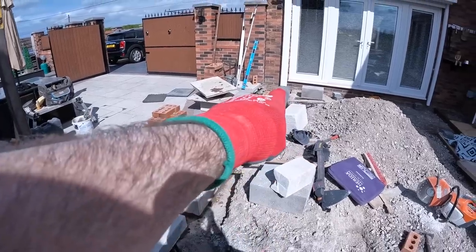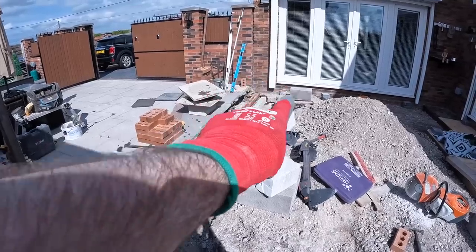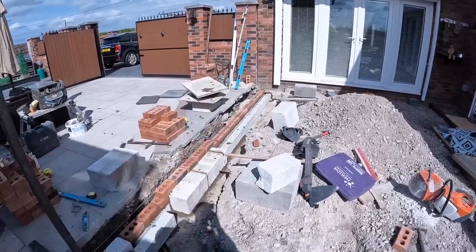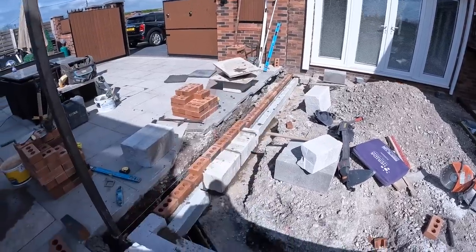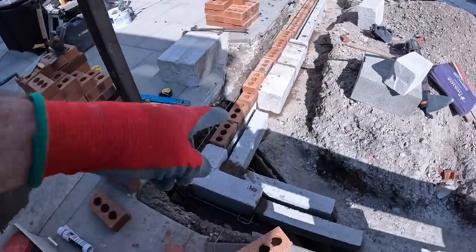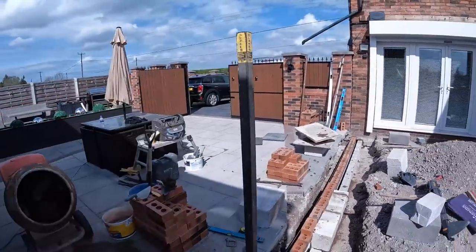So the bedding is the wall, you just see a bit of block work underneath there. They're bedded in tight, then they span across the crap. Even though it's reinforced and plugged into the wall, we're still playing it safe and putting the lintels in. A couple of trench block, all lintels over our drain here, and profile's up now. So now that's up, it's go, go, go.